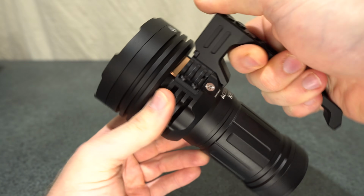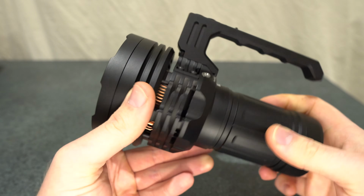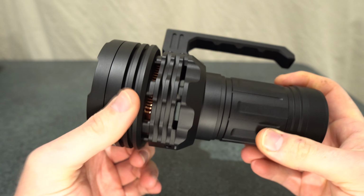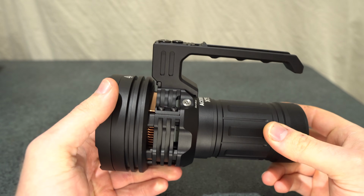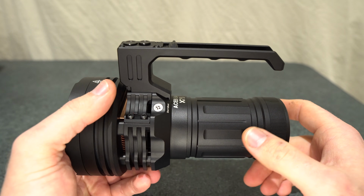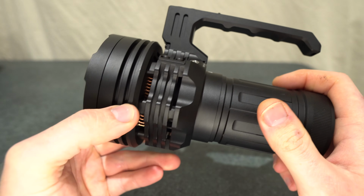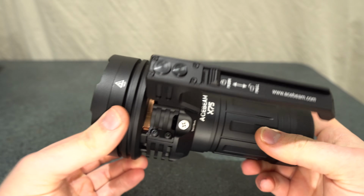The fan comes completely out of here. It's waterproof, so you can wash it, and the fan also as well. One thing I would be a little bit wary of: if the fan is running, you can turn off the fan with a single press of the auxiliary switch before you place it down, if you're perhaps on a farm or in a field where there are stalks of a crop that's been harvested, or stalks, grass or sticks in the paddock. The last thing you want is it going through these fins here into the fan and damaging the fan. So just keep that in mind, and always turn the fan off before you place it down.